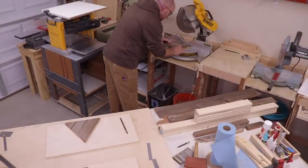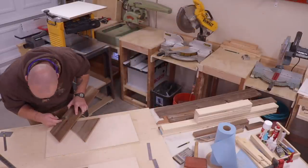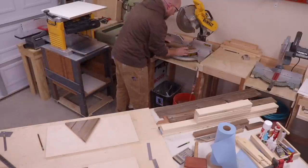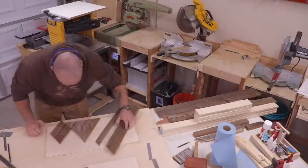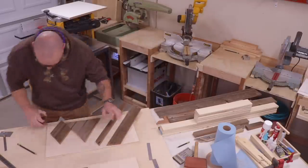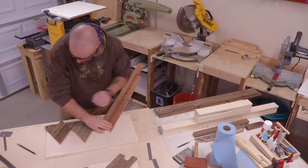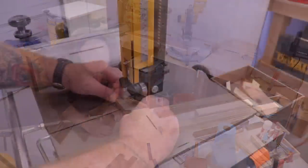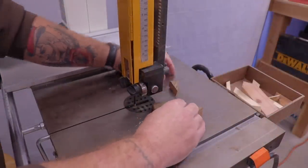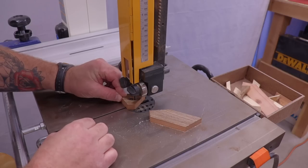The rest of it flows just like that, because with the 30-degree rule all your cuts are just going to be at 30 degrees — maybe you'll swing the saw the other way to the other 30 degrees — but the whole thing lays out the same. What's great is you can change your design as you go, and really you're only following that one mountain to the left and to the right. All your cuts end up being the same and you're just laying those pieces next to each other. For the end cuts I like to use a band saw to trim up the sides so I don't have to get my hands anywhere near a blade.